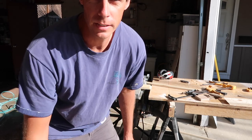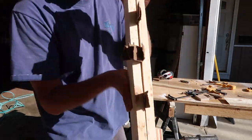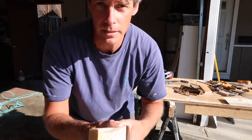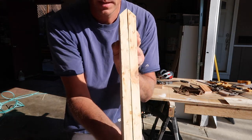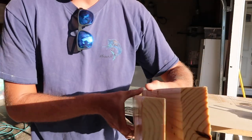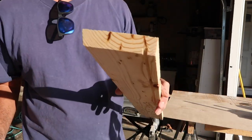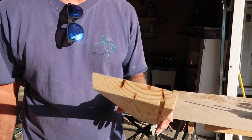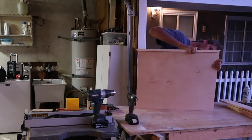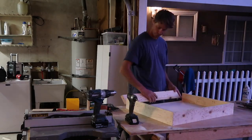Let's see if the drawer box pieces have straightened out. It worked pretty good — they straightened quite a lot. It's workable. I've got the front and back piece made. I've cut a slot just a little over three-sixteenths of an inch wide for the plywood bottom to slide in. The bottom of the cabinet box slides into the slots cut into the four face pieces, which are mitered, glued, and nailed together.